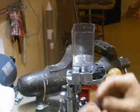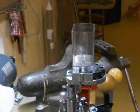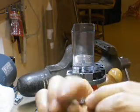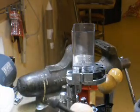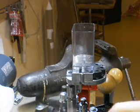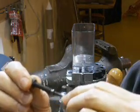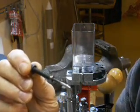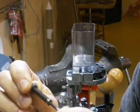The next thing I did was I took the screws that it came with, and I brazed on, actually silver soldered. Silver solder, what is it? It melts at 1250 degrees. It's very thin wire. It's not like regular soft solder. It's silver solder, so it's very hard. It's like brazing rod, except it's a very small diameter.